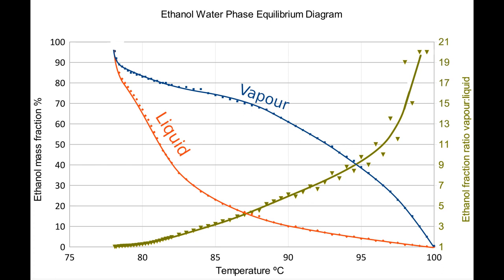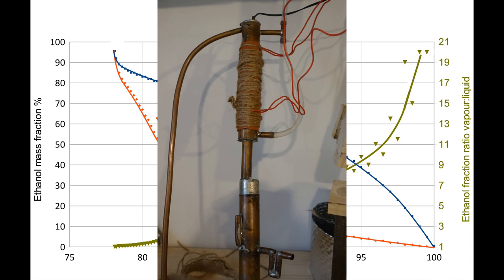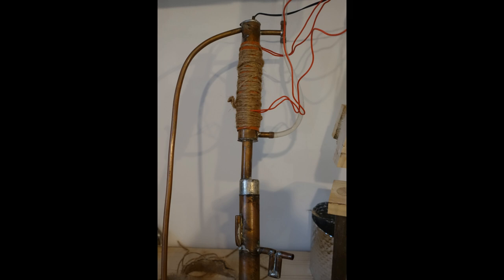I was running a continuous still with a 14% alcohol wash, producing a product of between 96.3 and 96.5% alcohol. I ran a series of trials where I fixed the top temperature, collected hearts and heads, and measured the quantities of both by weighing them. I timed the intervals of collection and calculated flow rates for products and heads and the ratio between them for each temperature. I also nosed and tasted the samples.